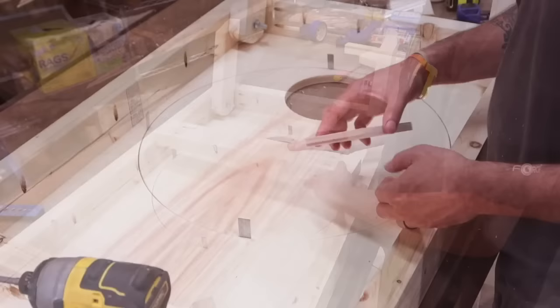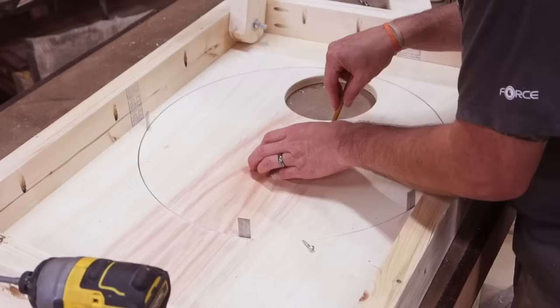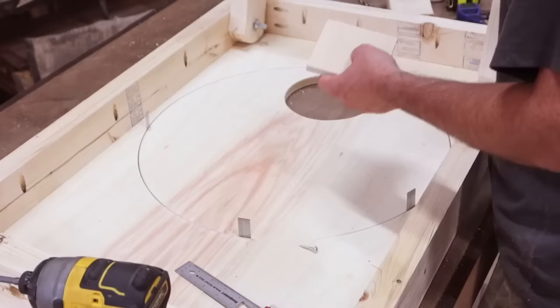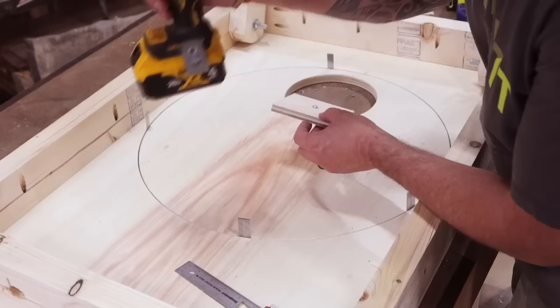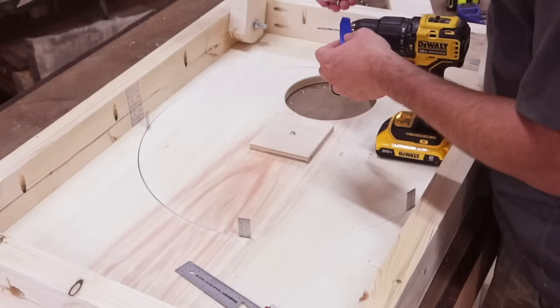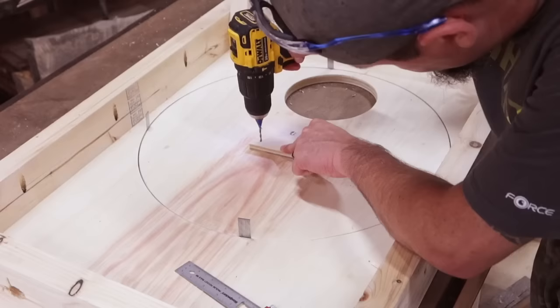Now we'll install our center block F — this is just a four-by-four piece of wood. I actually cut this from the leftover material from the hole we cut out. I want to find the center point of this four-by-four, so I'm drawing lines from corner to corner and drilling that exact center point. I'll place a screw protruding from the back so I can line it up perfectly, and insert this screw into the exact same hole used earlier for our jig when cutting the 20-inch circle — that should be exactly center. I'll pre-drill, glue this down, and place two more screws.